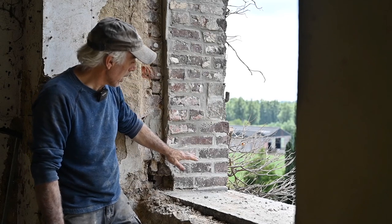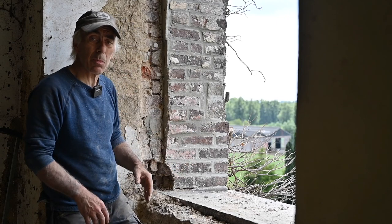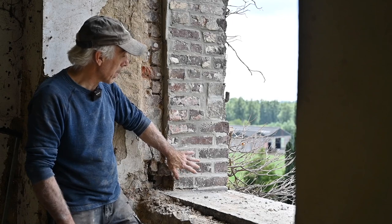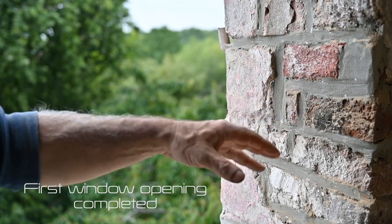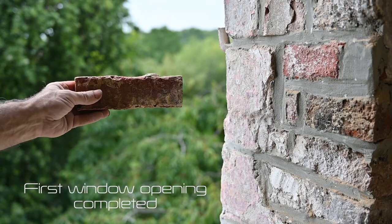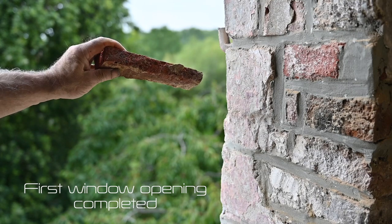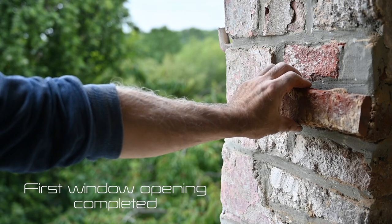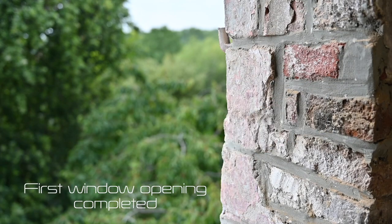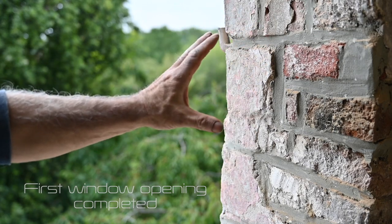You may see that the joints are not exactly aligned like what you would have on a new house, but that's not what I want — I want it to blend in with the rest of the wall. In some places I actually had to install half a brick or a slice of a brick. I took an original brick, ground off a piece, used a little mortar in the back, made it soaking wet, and then pushed it in there. That's how I'm repairing the deepest holes on this wall. I don't care about other small uneven areas because this is a very real building.